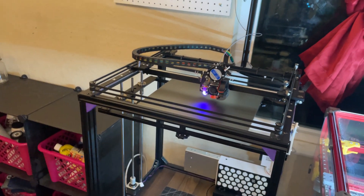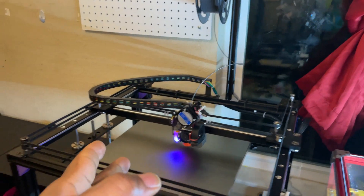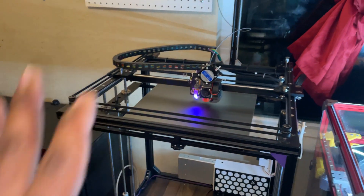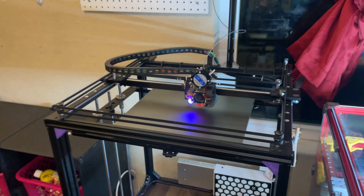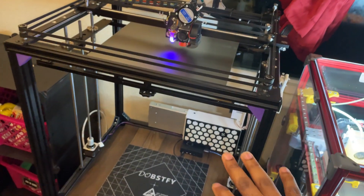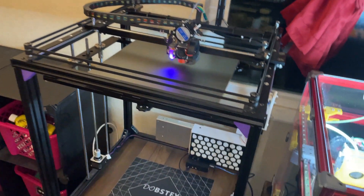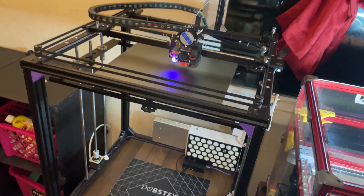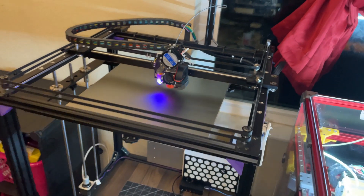It's not a highly modified X5SA — I try to keep everything as stock as possible. The only thing I've modified is the extruder area and the housing. I'm running an SKR 1.4 Turbo with five 2209 stepper drivers from Bigtreetech. They don't have the diag pin for sensorless homing, which I don't care about — I'm always going to use the switch.